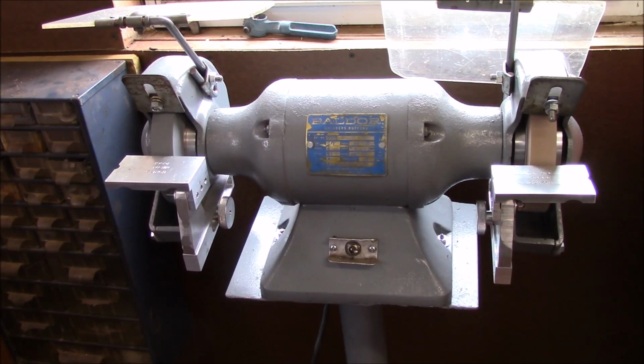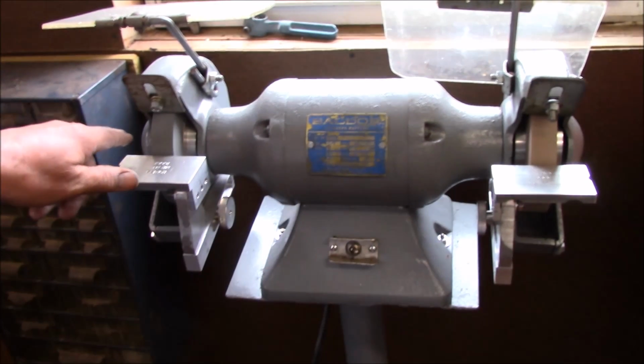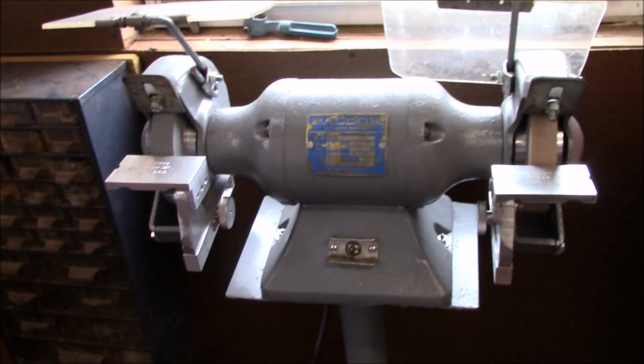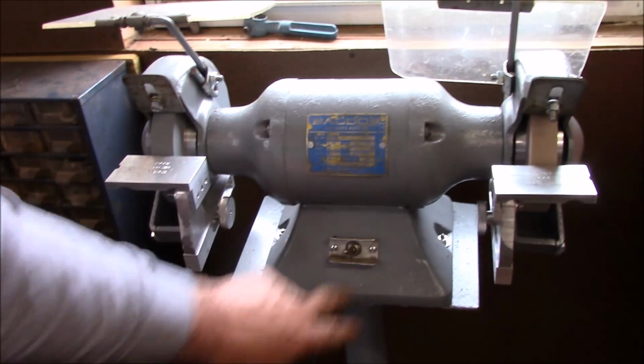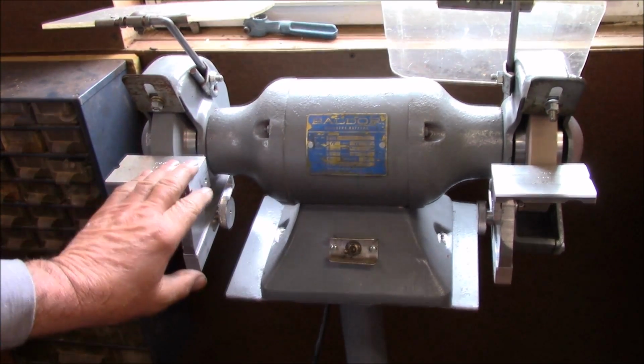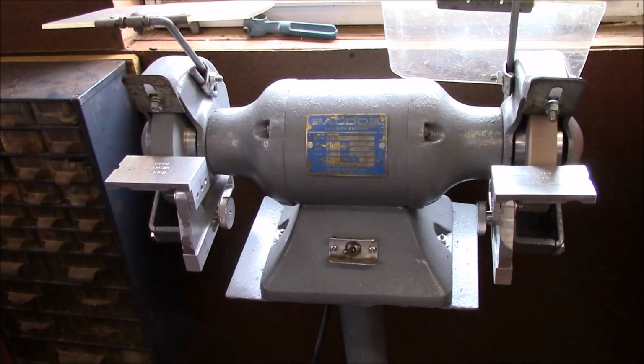But one of the shafts is bent. There's not a lot I can do about it. If you'll notice, you see how this side starts up here and how it moves. The shaft itself is bent. So that kind of causes part of the vibration. I might compress some of it out by dressing the wheel. I don't know yet. I haven't got to that point. But I've got really nice looking stands. And considering where I started, I'm pretty tickled.